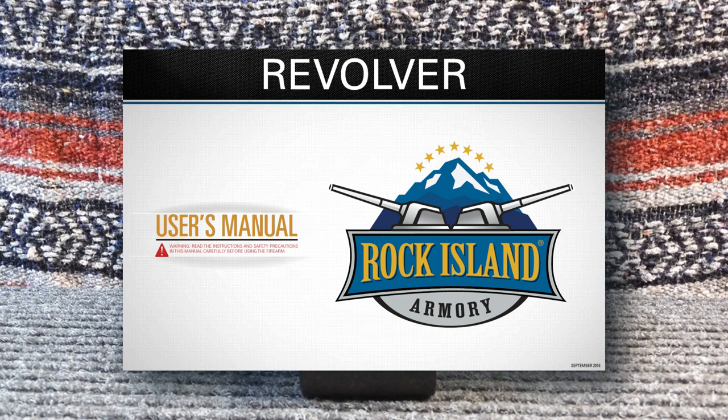Under normal cleaning purposes, removal of the cylinder crane link assembly is sufficient. To clean the revolver when not fired or after prolonged storage, rub the external parts with a slightly oiled rag and then swab out the bore and cylinder chamber with a flannel patch. Remove excess oil but leave a slight film to protect the metal from rusting. Clean all crevices with a nylon or brass brush. Do not over-lubricate.